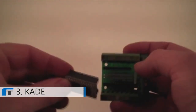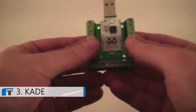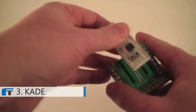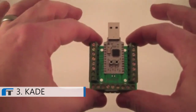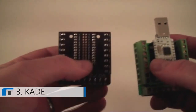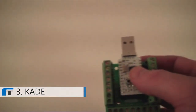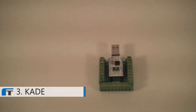We have a prototype where we've taken the microcontroller and have a board that you slide it right onto. The intention is that this board stays inside your fight stick or arcade cabinet. If you need to do any programming, you can just pull off the AVR, do the programming, and put the microcontroller right back on. This part stays in your cabinet with full size terminals — really good quality. We've got another prototype revision where we're changing some of the screw holes, and a third revision that just went off to the fabrication house, which seems to be the one going out on the Kickstarter.